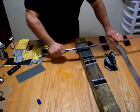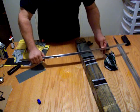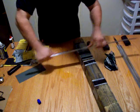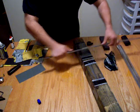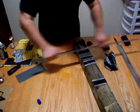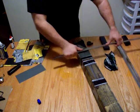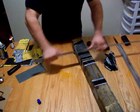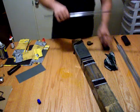When you're working this way, you want to be careful that you never let your blades slide the wrong way at all. If you have to, cheat by pushing it away from the edge. Push it away from the edge if you have to. If you don't trust yourself and you feel like you're being a little sloppy, that's fine — it's better to push it a little bit away and get a tiny diagonal scratch than to go the wrong way and ruin your edge.